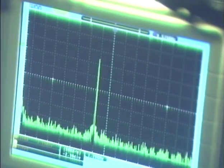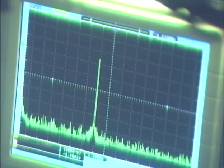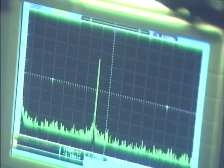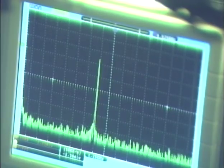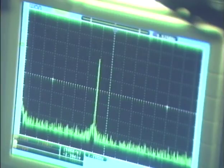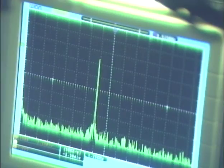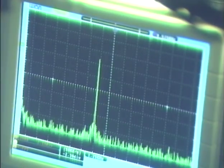Right now we are at 8.176K, so we're a little bit higher than we normally use, but if I can make an adjustment with a higher frequency, that's even better, since most 8-track players drop off around 12K, with only a couple of the most high-end 8-track players going up to 15 or 16K. So 12K is really a realistic norm. Adjusting it to 8K is going to bring it out just fine. And just to give you an idea of how high 8K is, we'll just turn this up briefly.